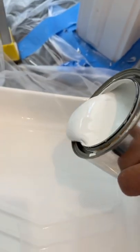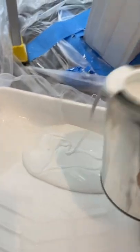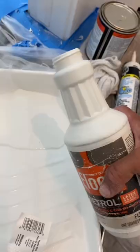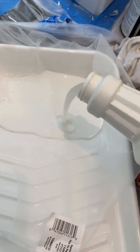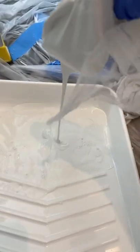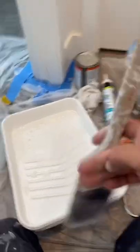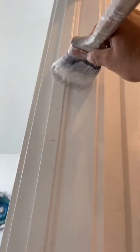I get my strainer so I can clean the paint out. I'm going to use my brush to apply the paint so the brush marks aren't as visible. This only works for water-based paint — I wouldn't use this for oil-based paint. Make sure you read the directions; I added too much Floetrol at the beginning and had to add a little more paint. Read the directions to get the right ratio of paint to Floetrol, then mix it up with your brush until nicely mixed and apply it.